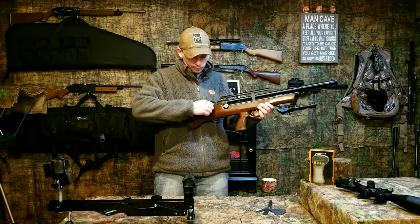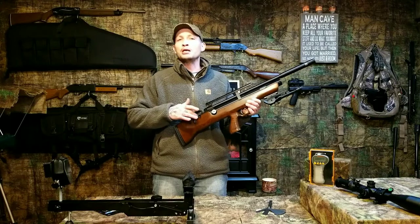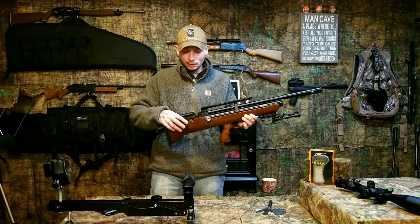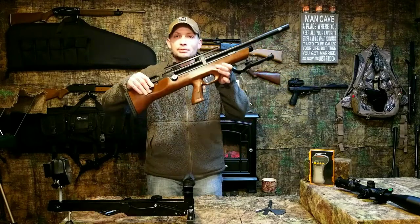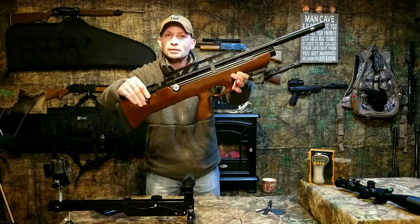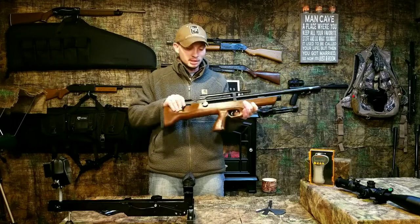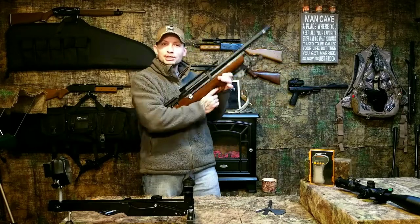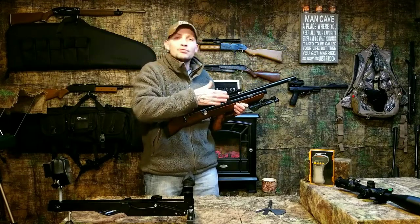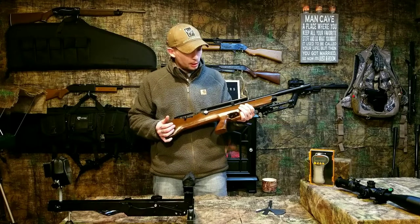That slop also makes the gun noisy. If I cock the gun and leave it in the rear-cocked position, that'll firm up and lock everything so the bolt handle can't jiggle. But just listen to the trigger — that's nothing but the trigger shaking back and forth. It gave me such a low-end feel. When shooting and taking my shot, you just bump the thing and it's so noisy, with a sixteenth of an inch rocking back and forth — just affecting my shot. I had to take care of that.